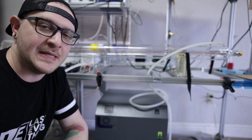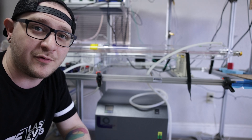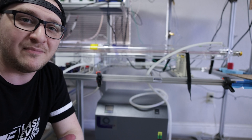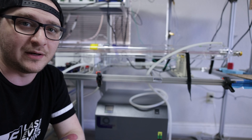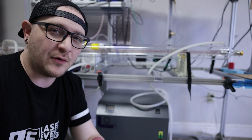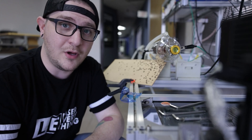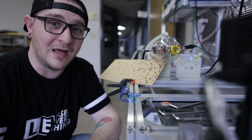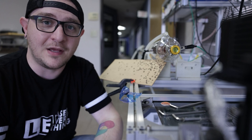So what did we learn? The SPT is going to be better if you have something like an OMTEC where you want to upgrade and add a beam combiner, because it's already built into the tube — all you do is swap the tube and you've got a beam combiner. If your system already has a beam combiner or you need a lot of power for cutting, the JK might be the better option since its output isn't hampered by a beam combiner. We also noticed the difference between the two is far less noticeable at lower wattages. Both tubes offer excellent warranties, and their power ratings were accurate when verified with the Newport power meter.